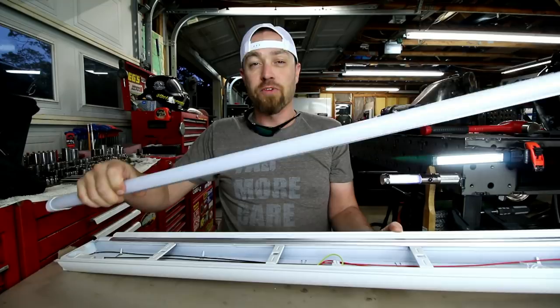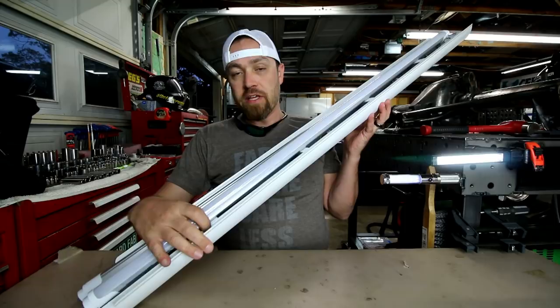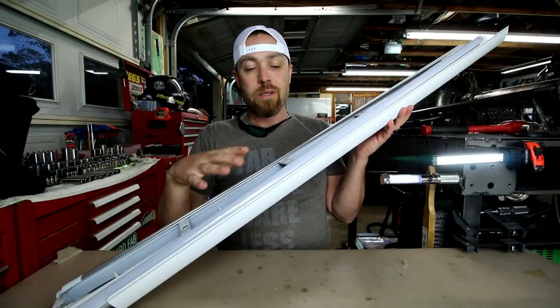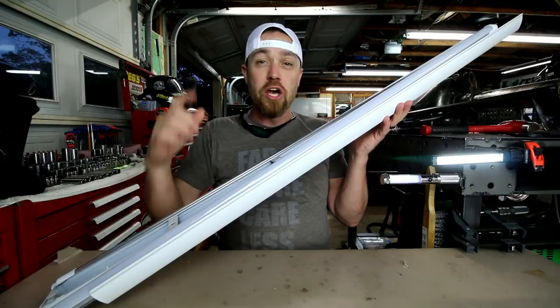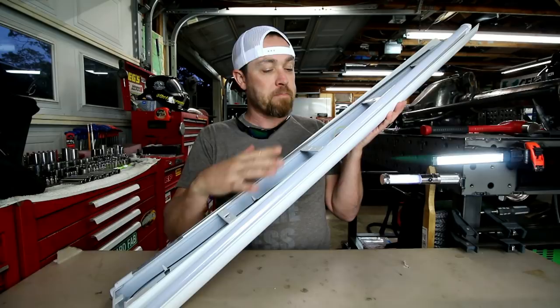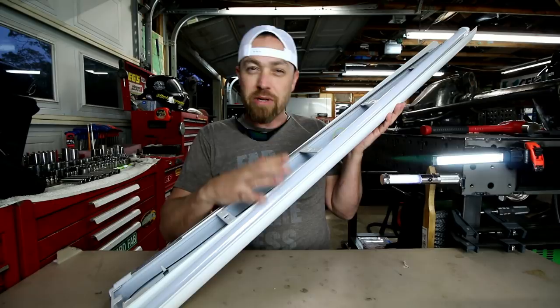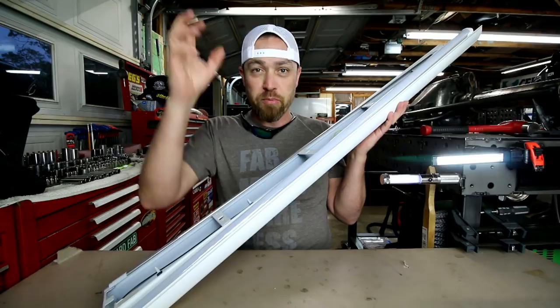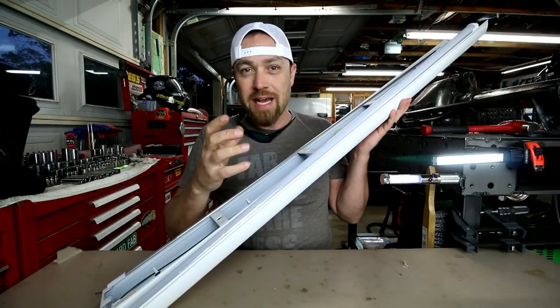You can actually buy these entire kits — the light comes with two LED-style fluorescent-style bulbs, comes with a case, everything you need. Obviously you don't need a ballast; there's no need for a ballast with LEDs — all of it's built in. I've kind of used a combination of this setup and the LED bulbs that can go in a ballast-style fluorescent setup. These kits are like 20 to 30 bucks — super bright, super clean light, no yellow, great for filming. Or you can just get the bulbs: they go in a standard setup, just pull your fluorescents out, the LED bulbs go in, pull the ballast out, rewire a little bit, and you're ready to go.